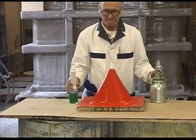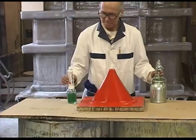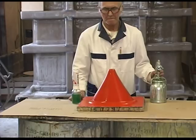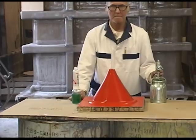In the summertime, it can sometimes take about 20 minutes to even an hour for PVA to dry, depending on the humidity in the air. Watch for deep pockets, especially if you're not getting air circulation. Remember that what we're doing is evaporating water and alcohol, and that, when it dries, forms a film on your mold.